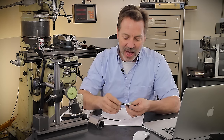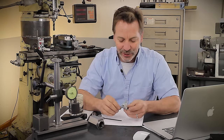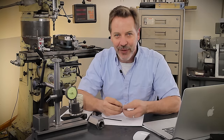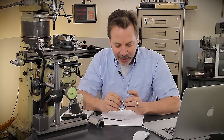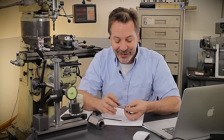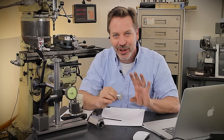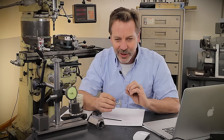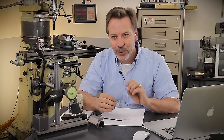What I've discovered using this type of dovetail is they're manufactured more by machinists than anything else. Machinists tend to do things at a very, very tight tolerance, and a lot of the times you can't slip the dovetail on. So don't be nervous about making it too loose a fit.